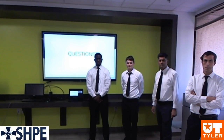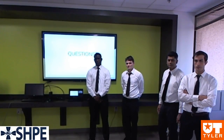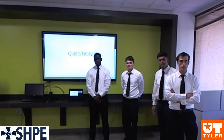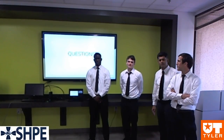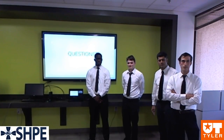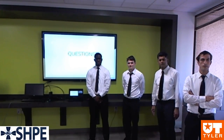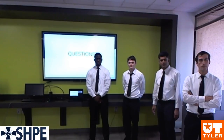That does concern me, especially if you're marketing this to a home gamer, somebody who's going to be having this in their garage. What happens if they have this in their garage, you're working on this, and then your 10-year-old comes in from the house and leans on it? It is obviously something that would need to be addressed in further iterations. I would encourage you to look at a larger factor of safety and also consider alternate loadings, like different loadings. So yeah, maybe you know not to lean on the thing. But what happens, again, if the toddler comes in?